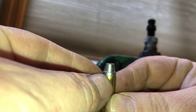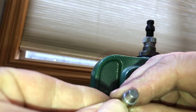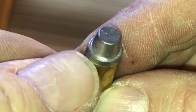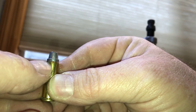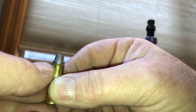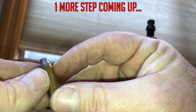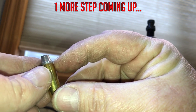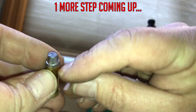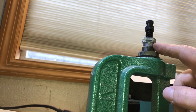The crimp is perfect: looking down the end you can no longer see the shell lip, and it's very slightly rolled in. That's a good crimp — easy, nothing hard, just rolled in so the top of the lip is gone when viewed straight on.